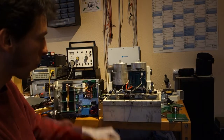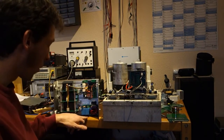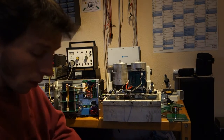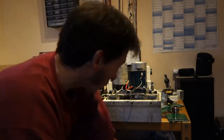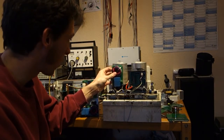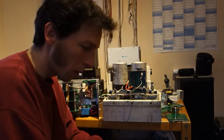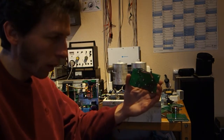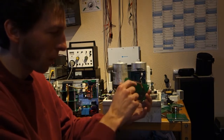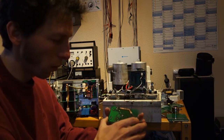Also, this is a simple LC grid filter that used to live in here, fixed to this capacitor, and was supposed to do the grid filtering for the integrated charging feature. I used it for about two hours and after that it looked burned — I'd done a bad job designing those traces. They are too narrow, and that's what happens when they're too narrow.